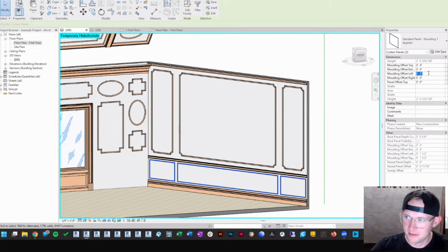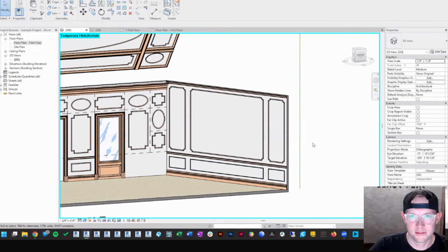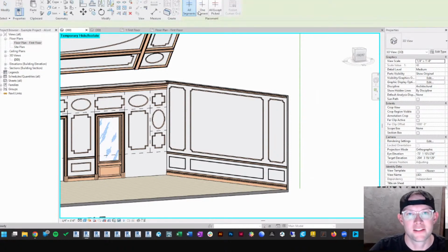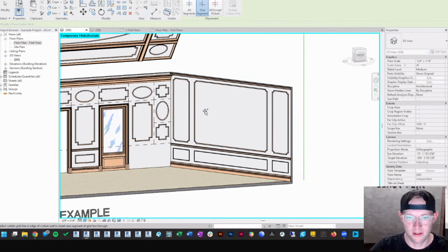And I think maybe since you're doing this, it would be helpful for folks who aren't living in curtain walls every day. What's cool too, as you're doing what you're showing me right now, if you go to architecture and add a curtain grid, you can add just one segment, and you can make 3-foot increments of the bottom, but that big square stays on the top. Let's do that. So what he's talking about is by default it wants to put a curtain grid across the whole thing. But if you just click this button, it's not going to sweep it across the whole height of the wall.